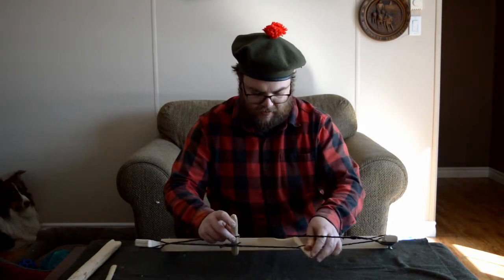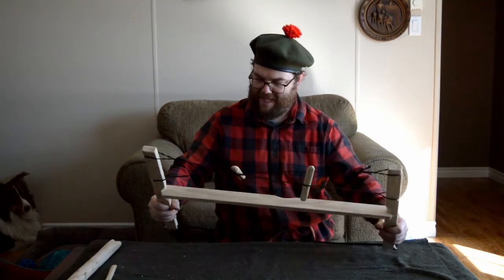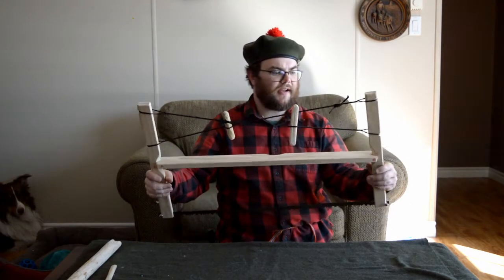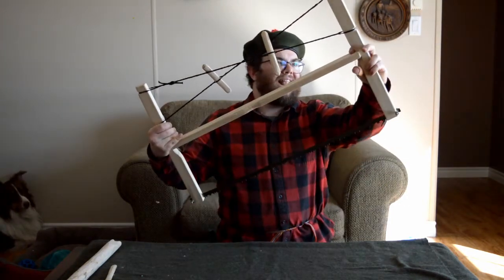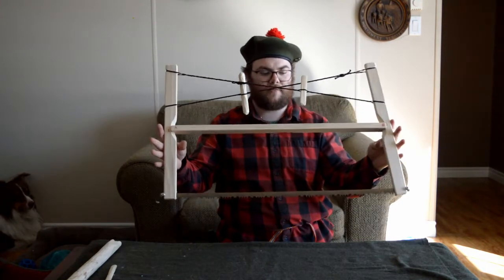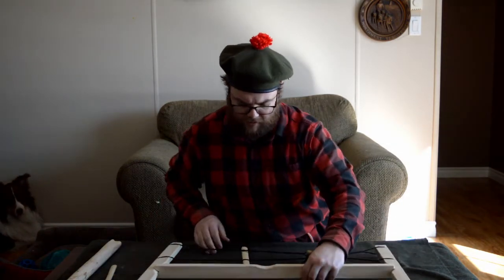In the previous version, we just wind these two guys up under good tension, and you end up getting a saw that has good rigidity. I like to mark out where my cross piece lines up so that everything is nice and straight, and you get a very nice rigid saw.